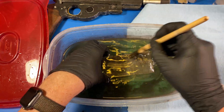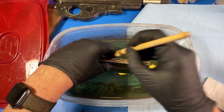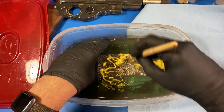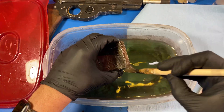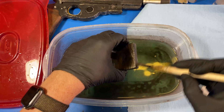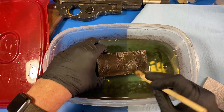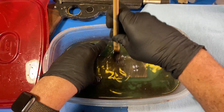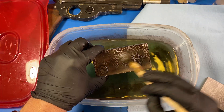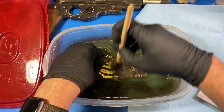I'm not going to be worried about the top surface blackening — I'm going to go ahead and sand this afterwards very lightly to try to repolish the top surface. One thing I found is this blackening agent actually leaves a matte surface, so if your surface is polished it becomes matte afterwards. In this case these are already matte. I'm seeing a little bit of a streak effect, so I'm going to keep trying to brush randomly a little bit.